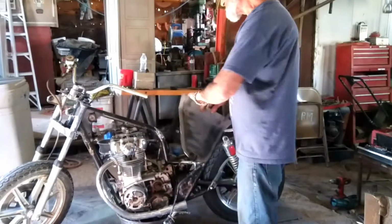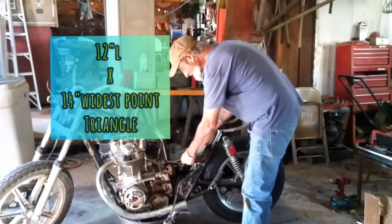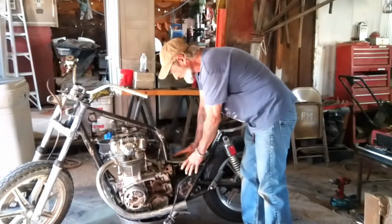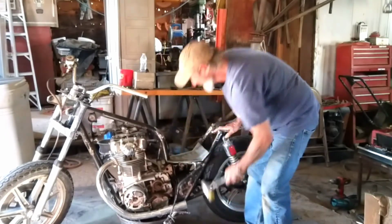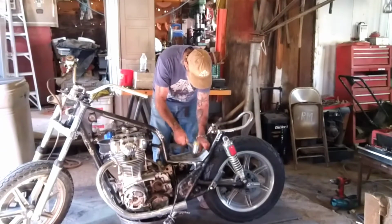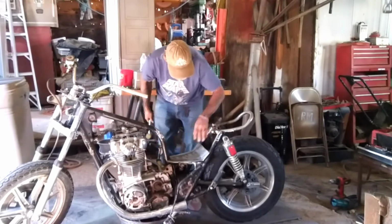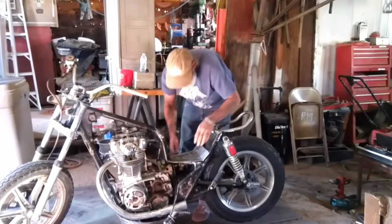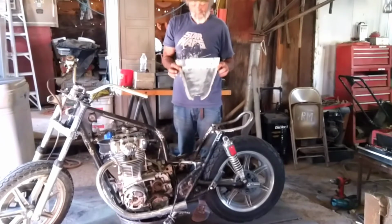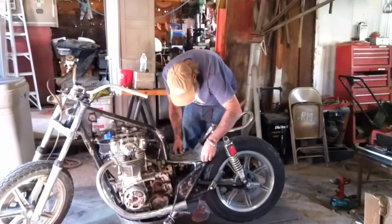I set it down right here. Cut it to fit, 12 inches. Cut the slot, set it down, bend it with the heel of my hand until I could get a good form fit. Then I took the old dead blow hammer, like right here in the middle. You see how the corners are? They'll come to a point, I want to retain that, I want to retain the shape of this. So I got it pretty much centered right there.